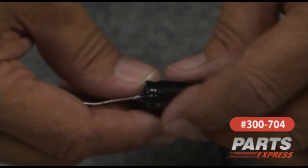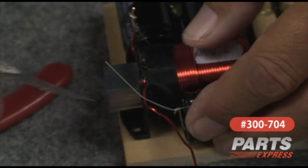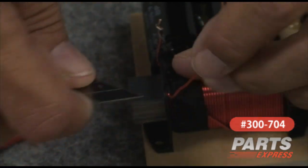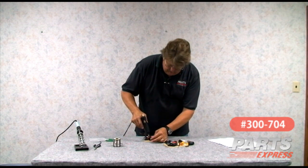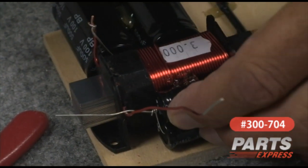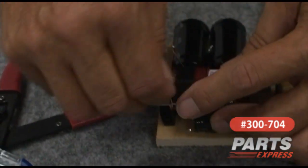Our cap is going to park right here, and our electrical connection is right here. Again, we need to clear away the insulation off of this wire so we can solder to it. I'm going to glue it into place — just a spot of hot melt glue on the board and a little on the side of the capacitors — and park it right there. That grabs pretty quickly, and then we'll wrap our lead around the coil lead.